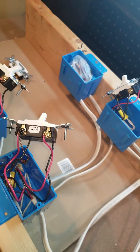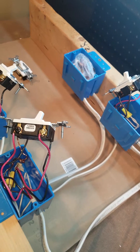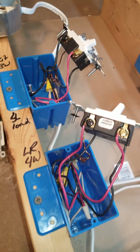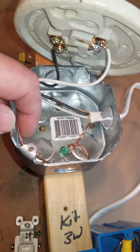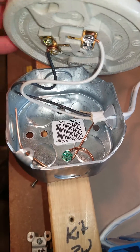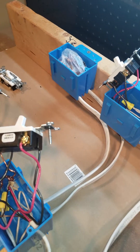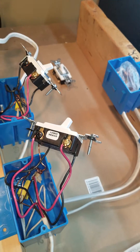I'm trying to keep this as fast and precise as possible, but also keep in mind you need to follow basic code compliances. Like in my example, I know the Romex needs to be supported in the walls. I know the boxes need to have at least two screws if you're going to use these type of boxes. I know my metal box for my light is too deep for drywall, but it's just an example — and if you do use a metal box, it does need to be grounded.